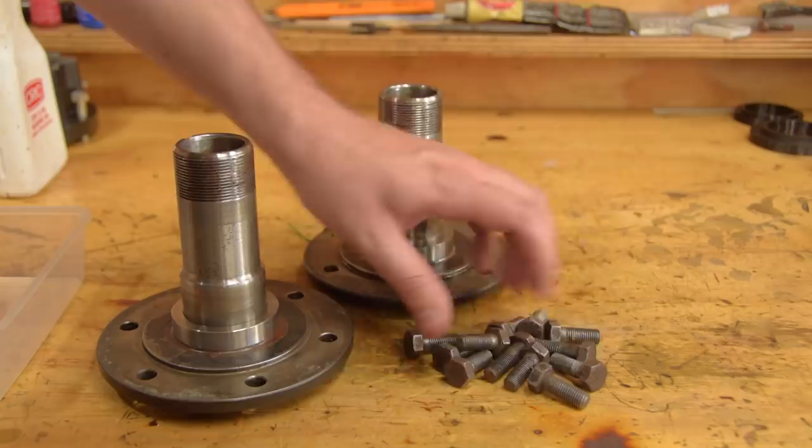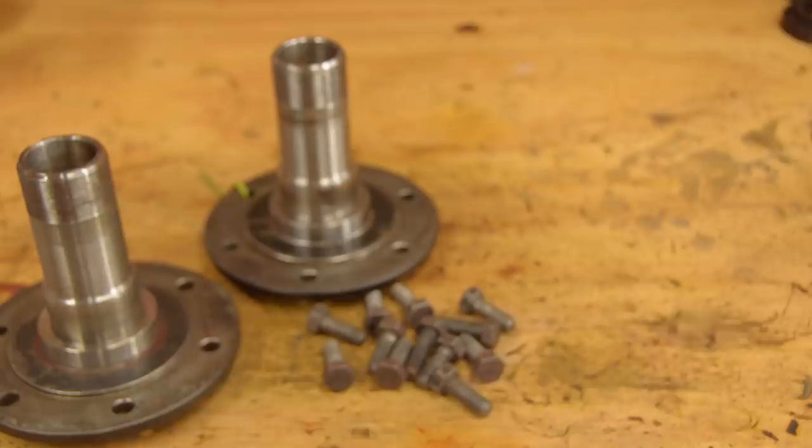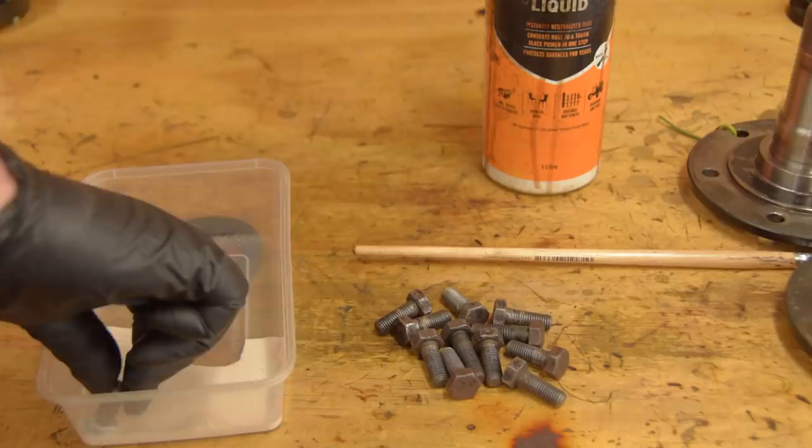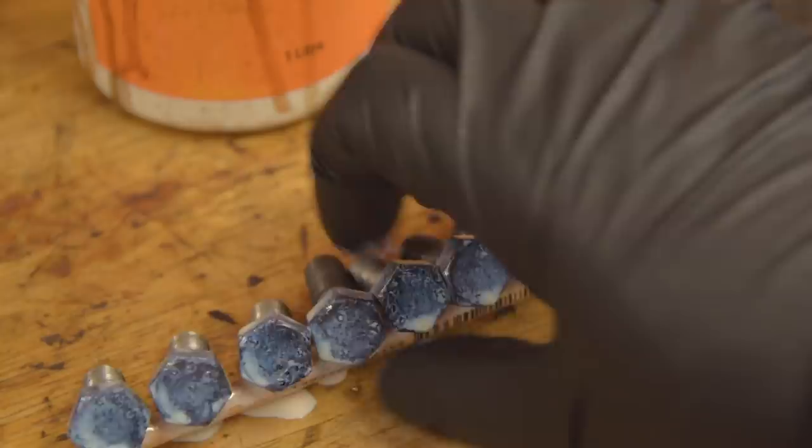See these? I forgot to order new bolts. These bolts aren't exposed and I don't want to stop and go through the whole plating process for this little batch. But also I don't really want to put old crusties back on. A quick and easy way to tidy up old bolts is to dip the heads in rust converter — the type that contains a sealer. It's a pretty durable finish and only takes seconds. I mean it doesn't look that great, but 5 out of 10 is better than rust.